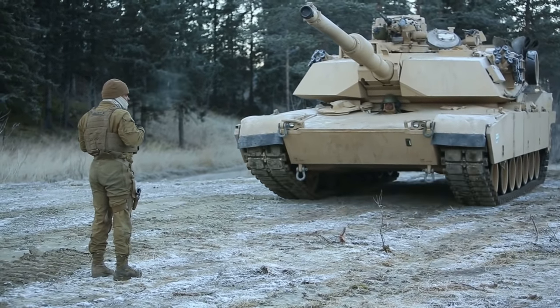The fire control system is one of the more innovative aspects of the M1. The combination of the power turret and two-stage magnification for day or night use makes rapid target acquisition and firing more stable. While the gunner ordinarily has a fully automatic system available, if things break down, he can go manual and input all major functions if possible. The tank commander and gunner share two main sighting systems. The gunner's primary sight, or GPS and LOS, has daylight optics for 10x and 3x field of view. The gun has two-axis stabilization, keeping the gun pointed precisely at a target despite the movement of the tank.